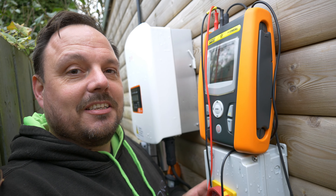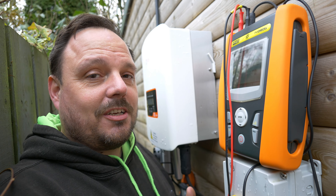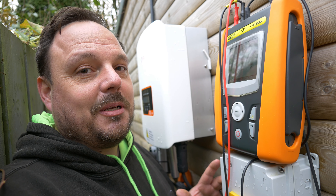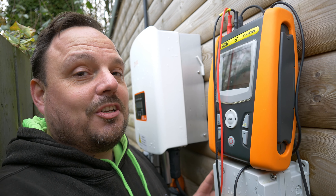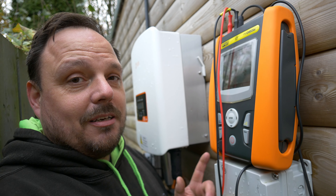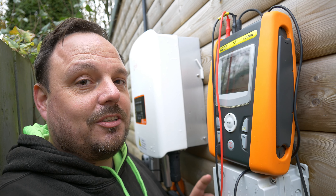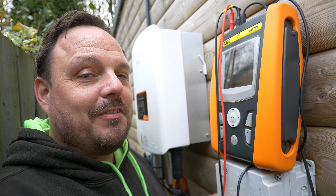You can see the panel is quite heavily covered with leaves and a little bit of algae that's starting to form — again that's due to the shallow pitch. I can jump up there now, give them a clean off, and hopefully get that performance level up a little bit higher. These have been performing excellently otherwise. Now the leaves are off the trees we're starting to see a little bit more coming out of even a flat array. Obviously in the winter months the higher your pitch the better the performance you're going to get. So these are always going to struggle, but they're still contributing. I've cleaned those panels off and hopefully it's back in spec. If you've got any questions about solar PV testing or any particular part of it you want to see, please drop them in the comments. Please don't forget to like and subscribe if you haven't already.